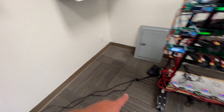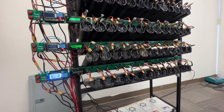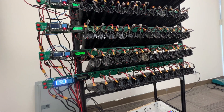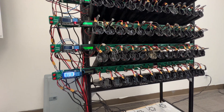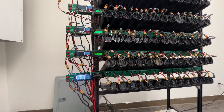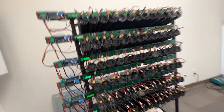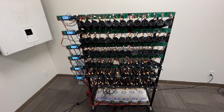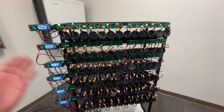We're also testing our AC power supply from the wall — it should be a 20-amp circuit, so about 2000 to 2200 watts. We'll see if that holds. If we trip the breaker, we'll need to find a secondary circuit to run half the rig. With all six running — and we did trip some breakers — you'll definitely need two circuits to run the whole thing.